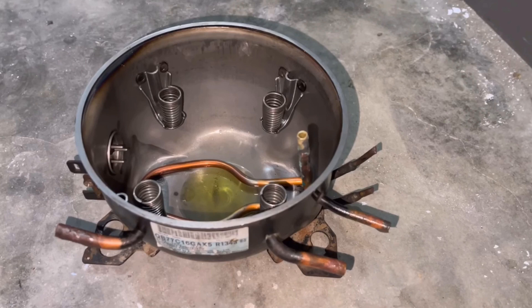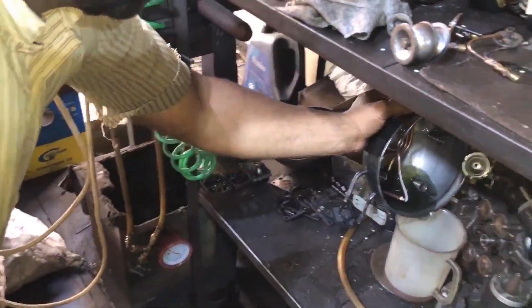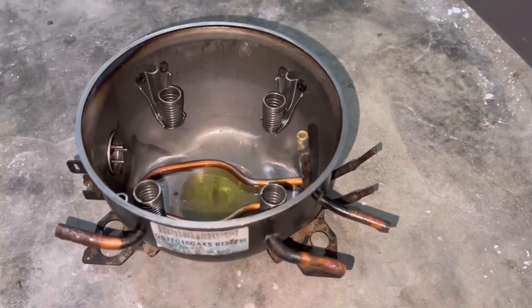The second reason is so that the oil can settle down. Well, when a compressor's running, the oil gets sprayed everywhere inside — it's more dispersed and unsettled than when a fridge has simply been transported on its side. Yet you can safely turn a fridge off and back on again five minutes later. And look how runny it is — it only takes a few seconds to drain back to the bottom of the compressor, not hours. So that claim is also invalid.